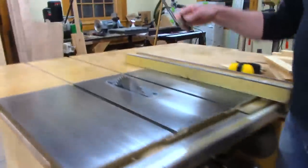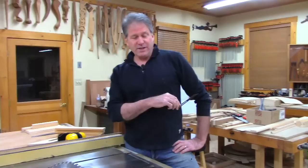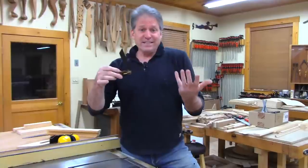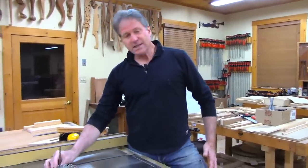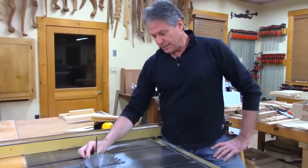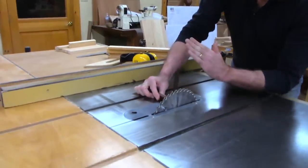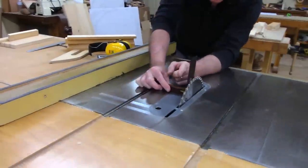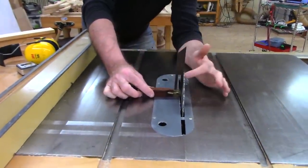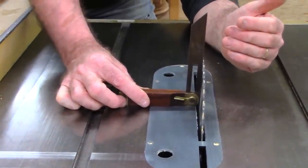So the beauty of working with bevel gauges like this, whenever I'm making chairs or even things like here, is that I don't know what these degrees are. And I don't really need to know, because I'm going to go directly to my table saw blade. I don't need the numbers. I rest it directly on the table, and I lean my table saw blade over. If you look right in here, I already leaned it over until it hit flat right between two teeth. So I know that blade is perfectly laid over for the angle that I want for these staves.